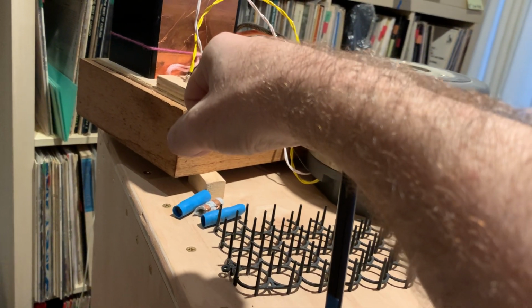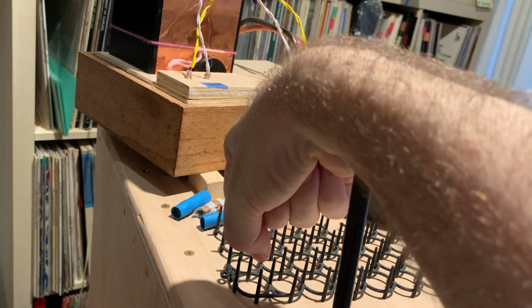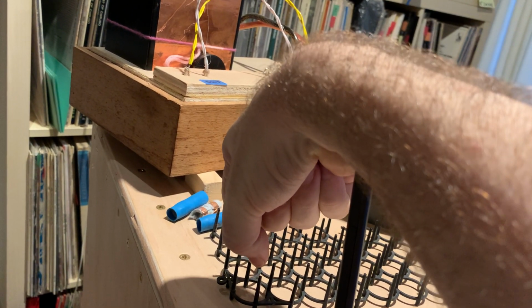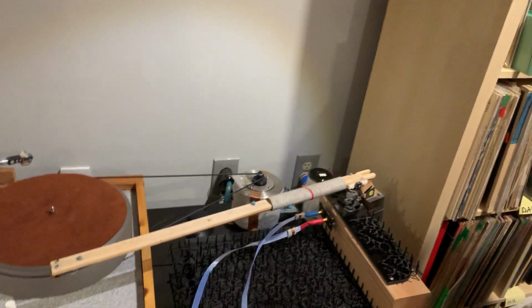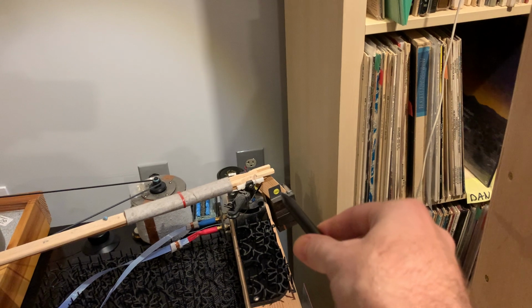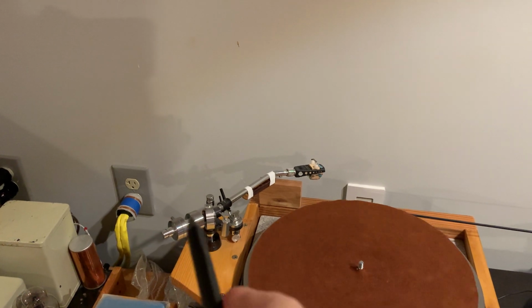Now let's take a lesson from boats, and the keel weight, it's lowered, and now if it's lowered, then the lateral movements are much less, because the gravitation holds the weight down. So that's the secret of unipivot arms. You have to just keep the weight low. So as you see, my counterweight goes not to the side, not to the back, unlike what we have with the regular arm. You see the counterweight is up here.